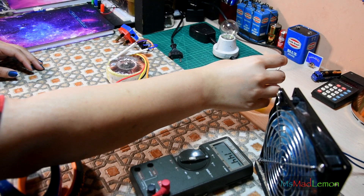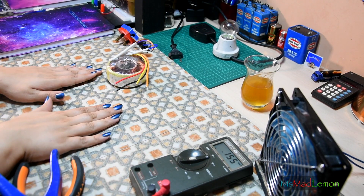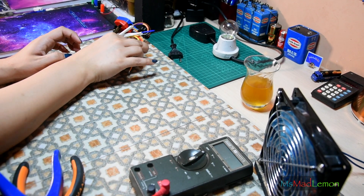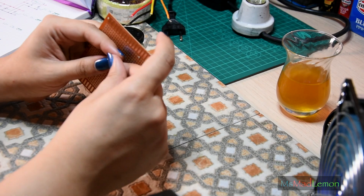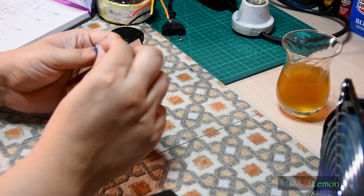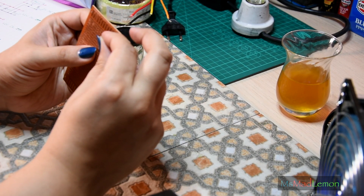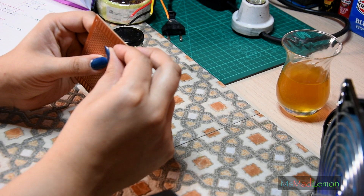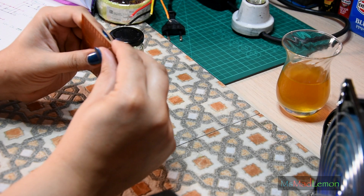So we've had a little fun, now let's have even more fun and start building this circuit. Now, people ask me why I use terminal pins when you can actually just solder directly on the board. Well, you can do, but this just looks neater to me, and if you want to desolder something, I hate desoldering off boards — it's easier to desolder off a terminal pin.